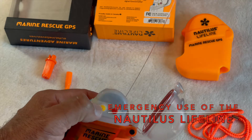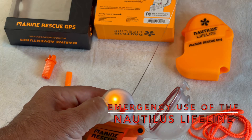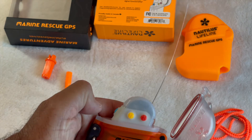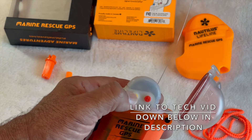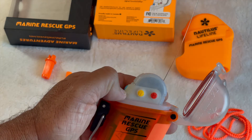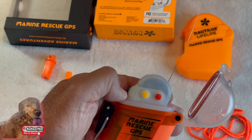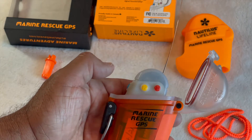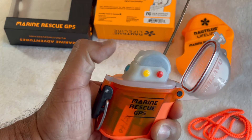This is operational. If I press and hold the red button for five to eight seconds, this unit is now sending information to the AIS system on board ships and vessels. If I hold it for another five seconds, it reverts back to the idle state — the blue flashing — indicating that it's got a GPS lock-in signal. And that's the use of the device. Very simple and useful in case of an emergency. To turn it off, press the blue button, hear the click, and it's off.